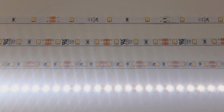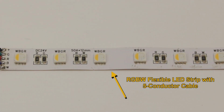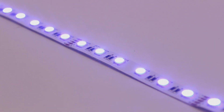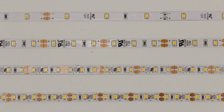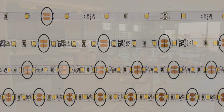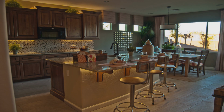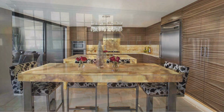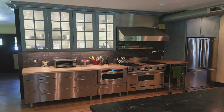We offer a range of brightness levels and color temperatures, including RGBW, which can be adjusted to any color of the rainbow. Regardless of color or style, Inspired LED flex strips feature the same wide copper pads which allow connectors to be attached at various lengths. Our in-house manufacturing team can make sizes to fit your exact specifications, or you can make your own in-field using our patented solderless connectors.